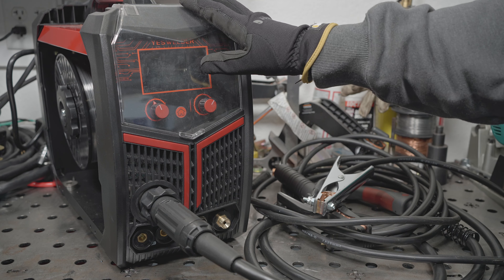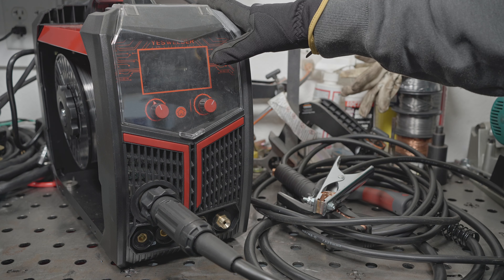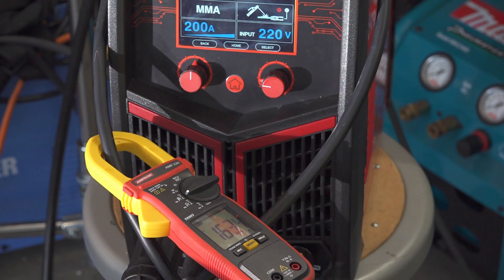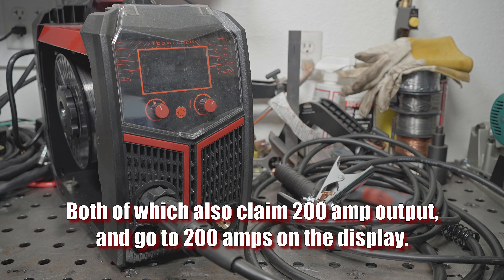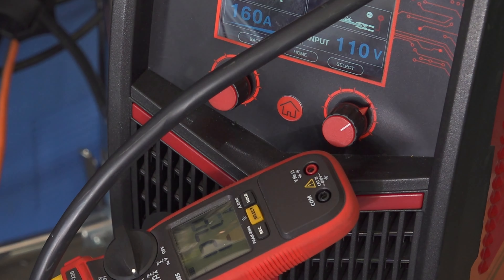This brings me back to the MP200 — this is the new welder they made after all the claims about fixing the problems, and yet it has the same problems. We already went over the inconsistent MIG performance with the auto settings in the first video, and as it turns out it also does not have the claimed output when stick welding on 240 volts. When the welder is maxed out at a supposed 200 amps, it is actually putting out the same 160 amps that I get out of the MIG 205DS and the ARC 205DS. On 120 volts, the welder claims to max out at 160 amps but it actually maxes out at 130 amps.